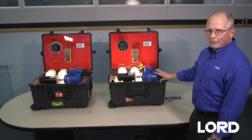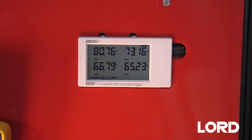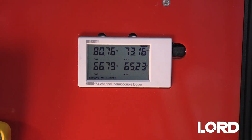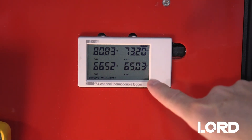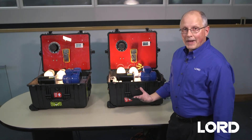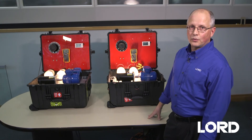If we then pot that motor with our high thermal conductivity epoxy, the end winding temperatures under the same power condition are shown here. On the left side it's 81, on the right side it's 73, and the skin temperature is 65 or 66 degrees. So that demonstrates that we have two motors running under the same power output condition, but this one is about 25 degrees cooler.